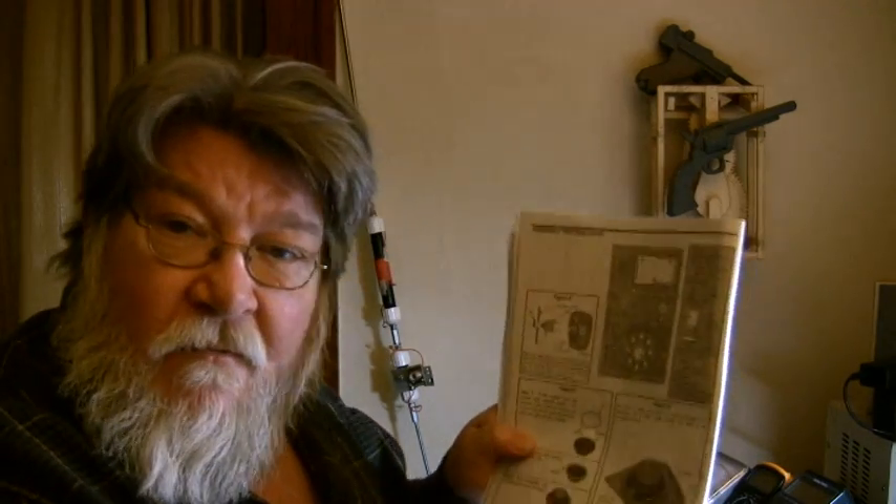I did step one — the assembly — and everything fit. The caps and resistors come on cards so you don't have to go look them up; you just grab it, put it in, make sure you're putting it in the right way, and solder it. I put the switch in, the LM386 IC, the battery holder, and the speaker. It works out real nice.